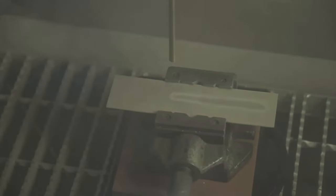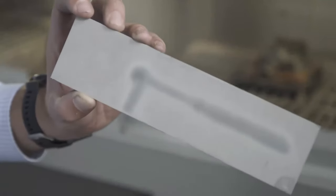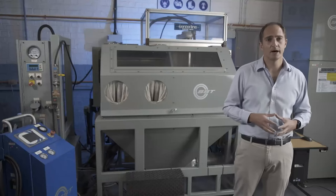Those powder particles are carried in the supersonic flow to supersonic speeds, then impinge on the substrate and build up layers. The kinetic energy contained within the powder particles causes adiabatic shear instabilities to form at the point of impact. This causes micro-welds to form and the particle adheres to the substrate. The powder particles do not melt — it is more of a sintering process.